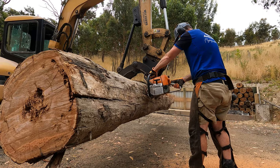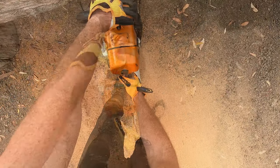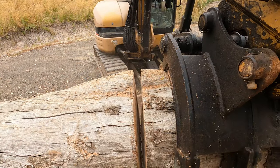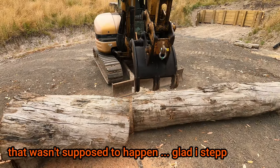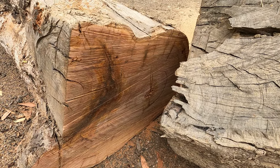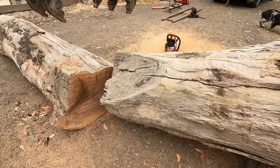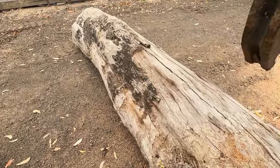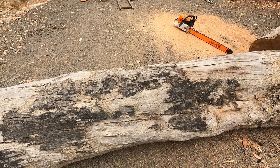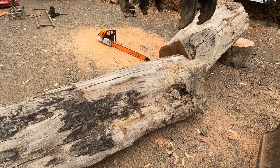Yeah, there are a lot of voids around this, but it is nearly solid all the way through — there's just a little hole in there. So obviously the rot starts at that end and works its way through, pretty much stopping there. So I should get another couple of boards out of this. I'm cutting them around about 1400mm long, and I'll cut this one in half as well. Then we should be able to set up the milling.